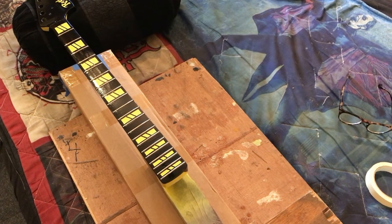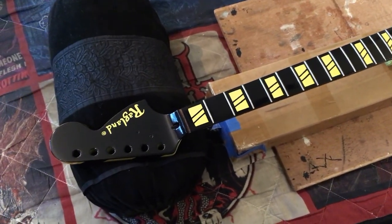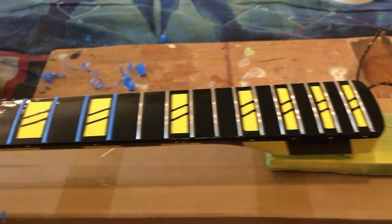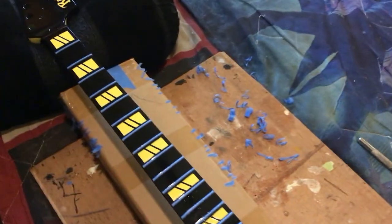Good morning — it's Tuesday, June 6th, 2022. Time to continue work on the Michael Sweet electric guitar. Today I've got the 2K clear coat Spray Max paint, and I'm going to paint the complete neck with 2K clear coat, minus the metal frets. So I'm going to tape up each individual fret. Halfway through taping — it's a slow, tedious process but it's going to be so worth it. The 2K is going to make it bright and brilliant.